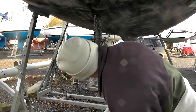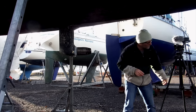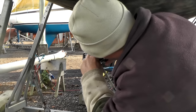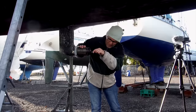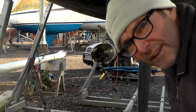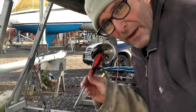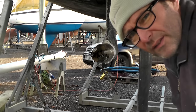So far so good - two prop blades. That's what I'm faced with now - hopefully that's just a lot of grease, because I can't really see what's there. It's not grease, it's just crud - barnacles and stuff. And we've got a nut with a tab washer, so I'll need a bigger screwdriver to use as a drift to flatten out the tab. I only have a collection of cheap old tools. It'd be much better with nice tools, but if I had nice tools I'd probably be more precious about banging them with a hammer - so there are perks to having cheap old tools.